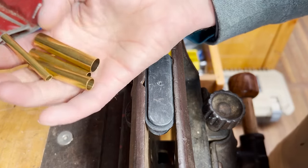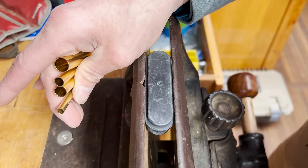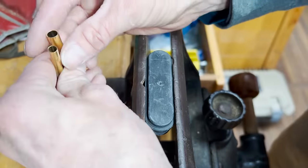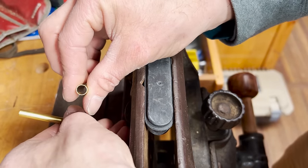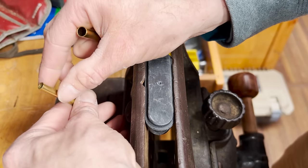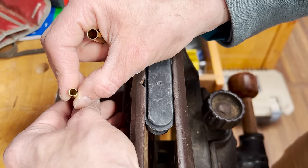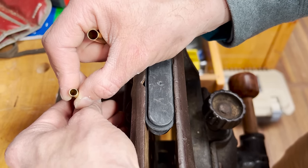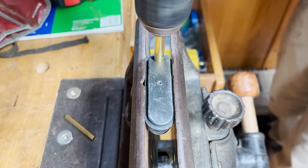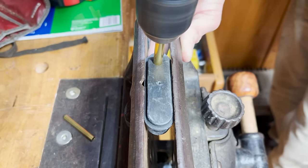So this cable gland comes with these four different little brass tubes, which are actually the cutters. So I need the two smallest sizes, and I'm going to need 5 total. 2 of the bigger ones, 1 for the Starlink, and 1 for the power for the radar, and then 3 smaller ones, which will be for the communication and power cables for the satellite compass, the satellite weather, and the radar. So I'm going to do the big one on the top, 2 of those, and then 3 of these little guys, and this basically just cores this rubber.